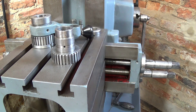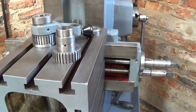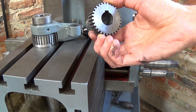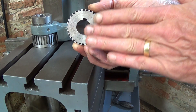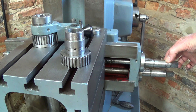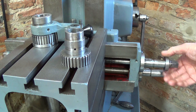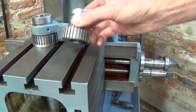Make a mistake and you break the machine. My machine dates from about 1963. In later versions, Elliott themselves built a clutch into this ratchet mechanism, but it operated by a friction pad on this face, and it required a screwed thread on the end of this shaft. Basically, a collar would screw on and as it did, it increased the friction on the pad, which gave the clutch effect.